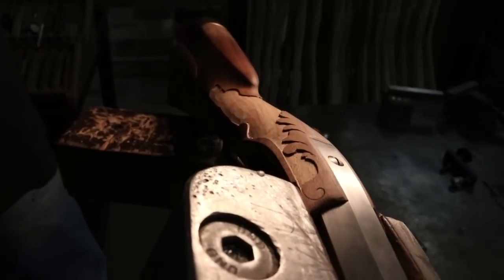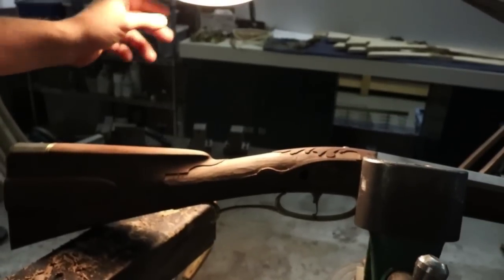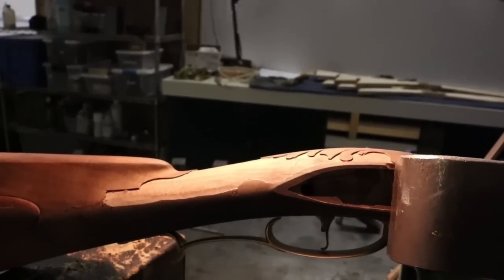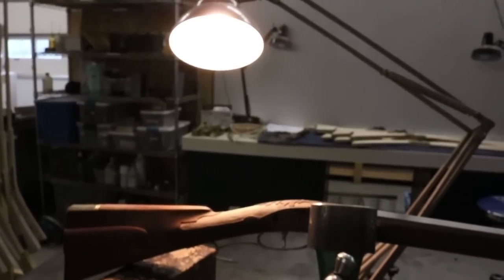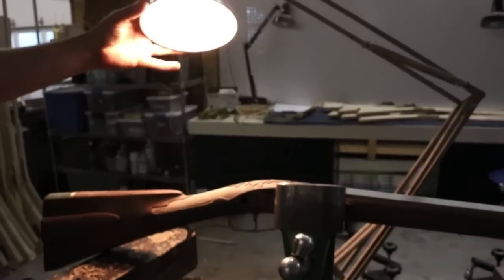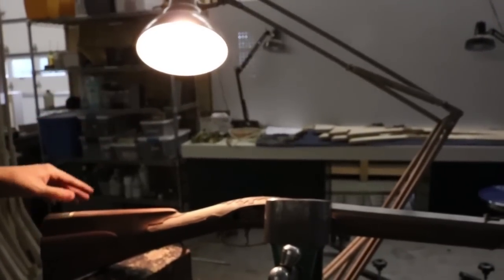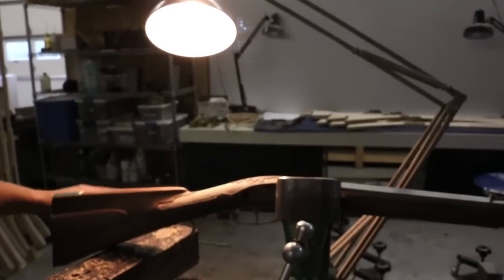One important part of that is your light. When I move my light, it shows the facets very cleanly; if I move this light just a tiny little bit, it doesn't hardly show them at all. So when I'm carving, I typically move the light all the time, because I want the carving to look as bad as I can while I'm carving it — that way I can identify which areas need to be pared down to level the surface. Cross lighting with a directional light source is very important. I've actually dimmed the overhead lights a little bit, so I just have this articulating arm light. I use old incandescent bulbs — rough service ones, you can still buy them. I like them better than LED or any other type.